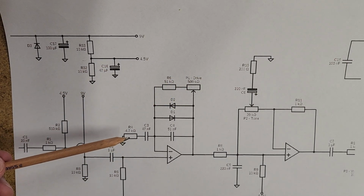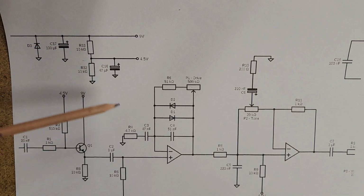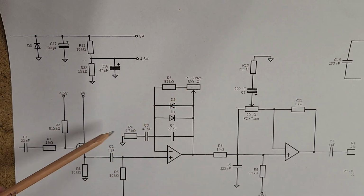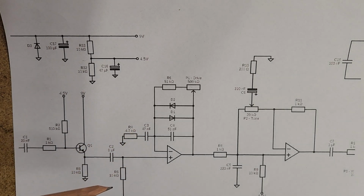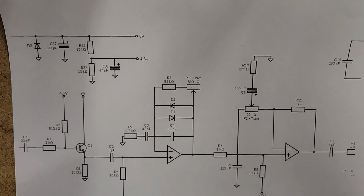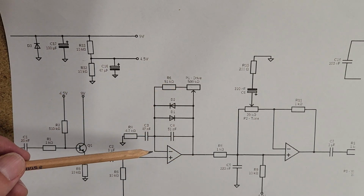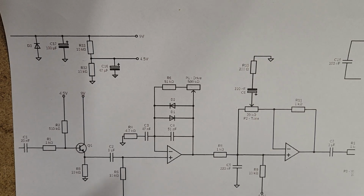And it might be hard to see, but that's the same setup as this voltage divider here. We have one resistor, then coming off in the middle, and then another resistor going to ground. So that's creating a voltage divider. We can forget about that cap. That capacitor is just there to smooth out the signal a little bit, but all we've got is a voltage divider here. And without going into the voodoo that is operational amplifiers in a lot of ways, the difference in that voltage from what's going in and going out and going back in is what is going to be amplified.